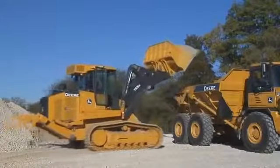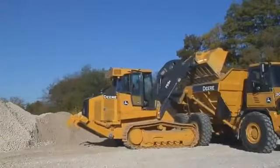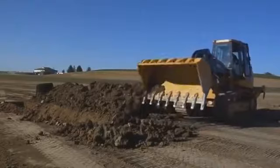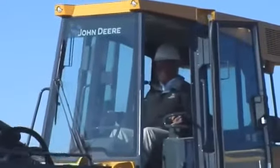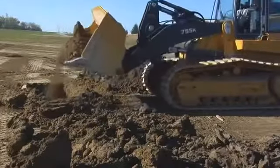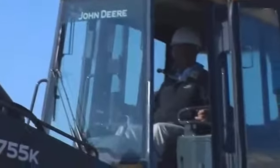When using the loader, keep the loading surface smooth and level. This not only makes it easier to load the truck, it also improves stability when the boom is being raised. It's important to be careful when working close to a trench to avoid a possible cave-in and accidental machine overturn. When backfilling, a good method is to attack the pile at an angle so the dirt folds gradually into the backfill area. This helps avoid large chunks of dirt causing damage to objects near or in the trench, and also helps with visibility down into the backfill area.